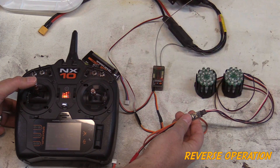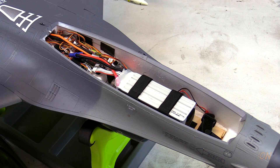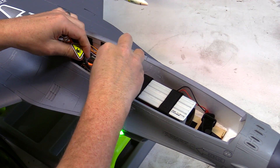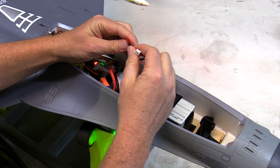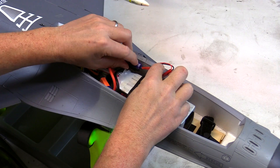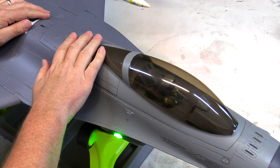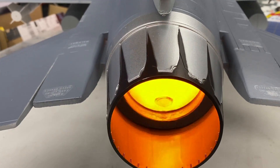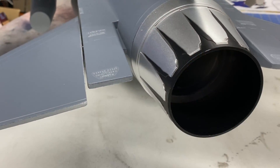The lights should be powered by a small 2S LiPo battery for maximum brightness. I use a small 2S 250 milliamp hour LiPo — I have a link in the description for the perfect match. It's an extremely lightweight and small solution that doesn't draw an imbalance on your flight pack and lasts many flight outings on a single charge.